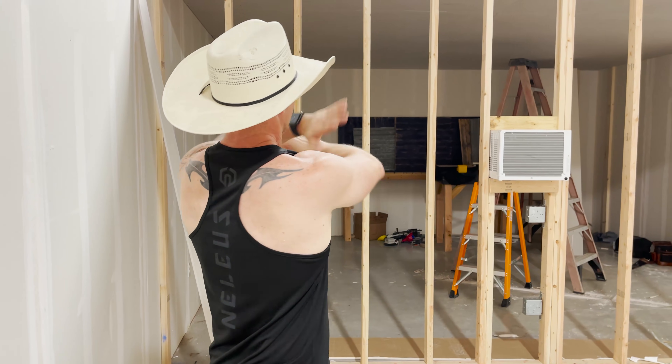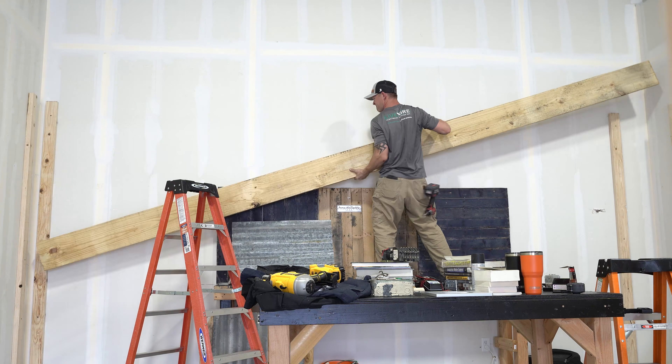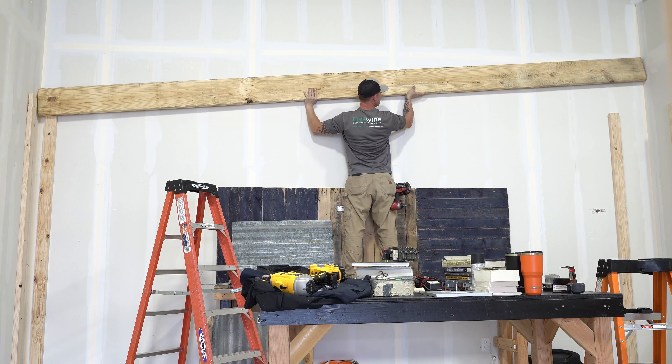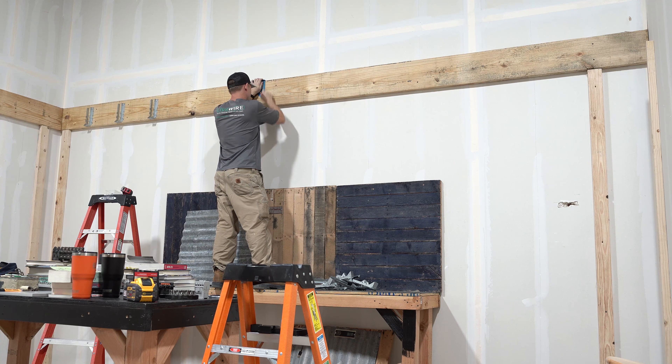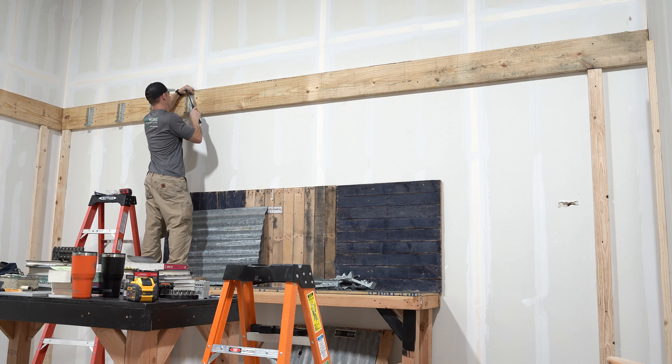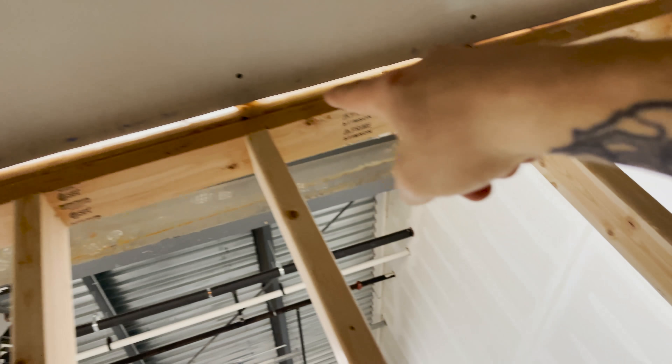What's going on, my friends? This is Dustin Stelzer with Electrician U. We got another studio update, just keeping you guys in the know about what I'm doing. I finally got the whole room framed up. I had to do a whole bunch of framing in the ceiling — I had 16-foot 2x10s that I had to lift up there all by myself. Once I got the board up there I started putting joist hangers — I put a joist hanger for every single one of them and made sure I put solid nails into every single spot on the joist hanger. Then on the other side I took my nail gun and toenailed each one of the studs in place, and I made sure I lined each one of the trusses up in the ceiling with an actual wall stud so it balanced the weight out evenly.